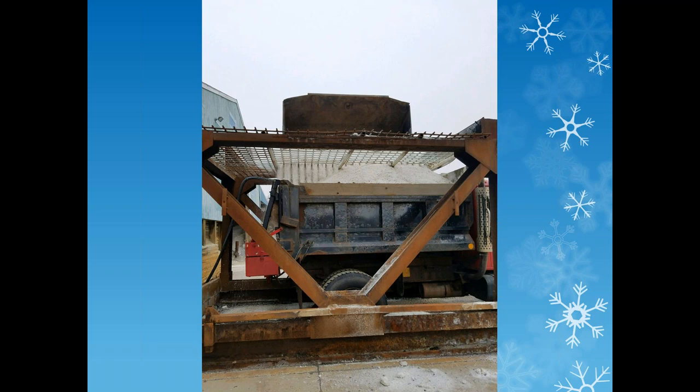This slide came out of Knox County—they were having issues with their augers jamming. They came up with the idea of screening all the salt that goes into their single axle dump trucks. They used an old truss bridge, welded it up, and put a grate across the top. It worked out really well in preventing clogs and jams in their auger system. At ODOT we put a more powerful hydraulic motor on our auger system to grind up salt chunks, but we still deal with hot mix and debris that gets mixed in.